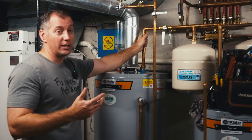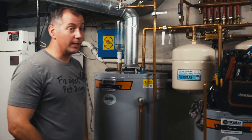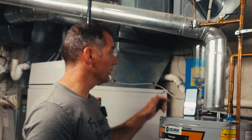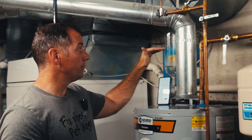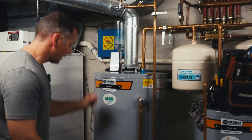We're going to set the water heater to about 120°F. The incoming water is probably a little more than 50 degrees, so we might not get a full quart of expansion, but we're going to try it out. I'm going to get my phone out and use a stopwatch to measure how long it takes for the water to actually start rising. Remember — open body of water, just an open tank, under no pressure. We're going to watch the volume of water increase with nothing other than temperature increase. Let's start our stopwatch.